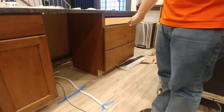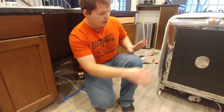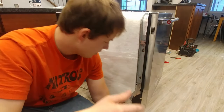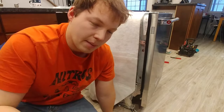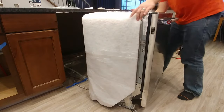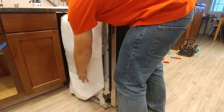If your floor is really out of whack, you're going to want to do some shimming in the back portion of the hole so that the wheels have a nice even surface to sit on. Now we're going to work on getting this thing over and starting to slide it in place. We've got to make sure we get this started through that hole. In order to get that cord through there I had to pull my drain line back out temporarily — I wouldn't go with any smaller than an inch and three-quarter hole. Our wire is started in there and our utilities are underneath, so we'll start sliding this thing in, making sure that our sound blanket is going in okay.